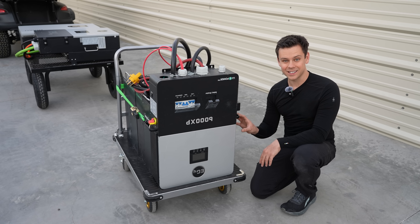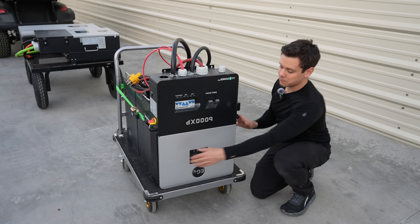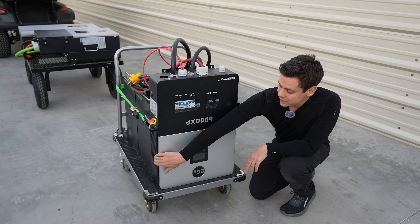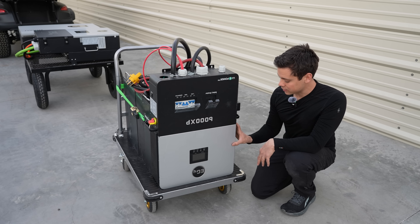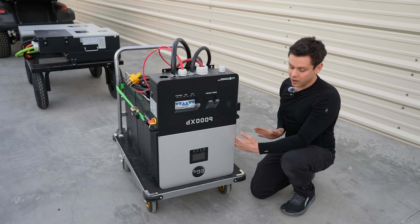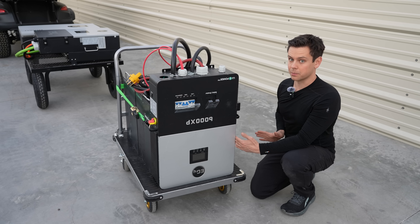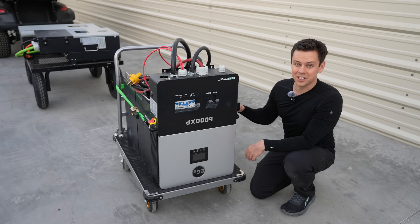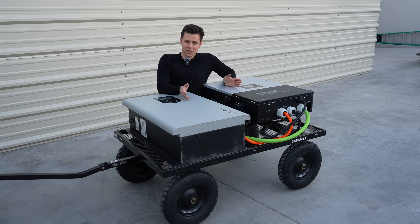To ensure this thing does not overheat you need to have space on both sides so it can breathe — this is the air intake and this is the exhaust. The manual has a spec for how far to space inverters apart, especially in parallel operation. But overall I don't think overheating is a concern at all.